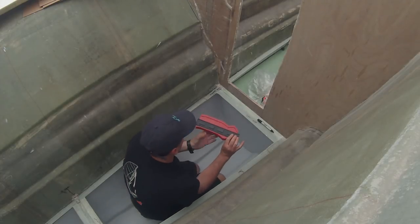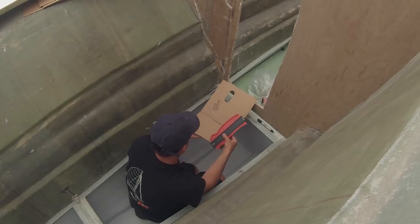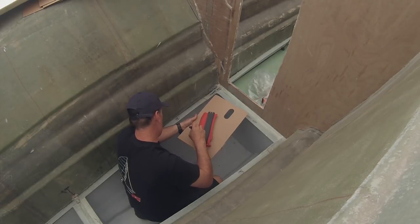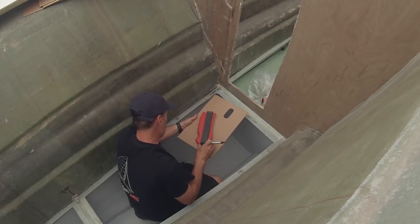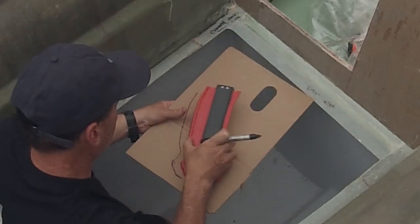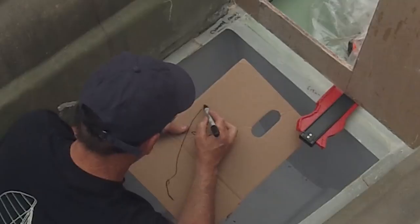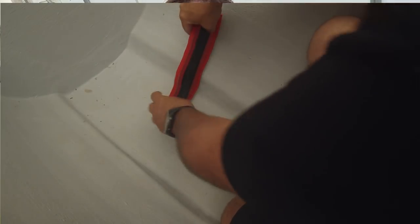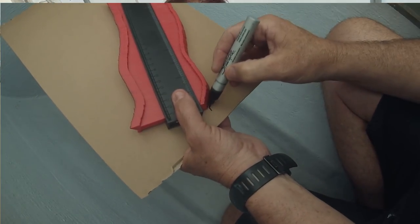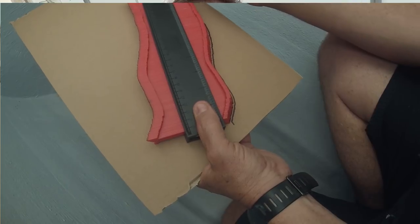We're going to support the tank on each end to get it level and make a quick, very useful mount. I'll put three or four layers of glass over it and put some straps on the top to tie it down — similar to what I did with the fuel tank. I've been racking my brains how I was gonna do it. I don't believe in wood down in the bilge, but I'm gonna give it a crack and use that new tool to work out exactly the shape and contour I need to form these mounts.